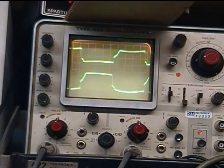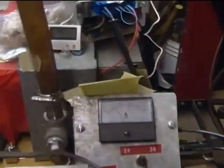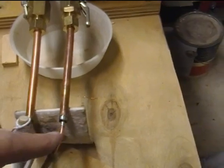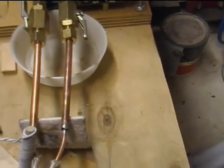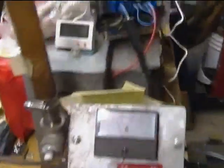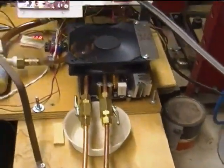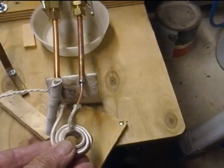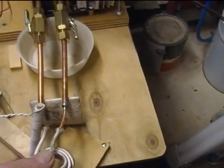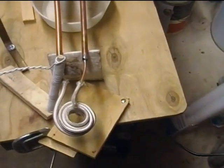One more time. I'm actually dimming the lights as the power supply goes up to 30 amps, which is a lot more than it's supposed to. I've now had the system powered up and running at 14 amps using this tiny 1/8-inch OD tubing with my existing water pump system for about 9 minutes. We started out with a water temperature of 74 degrees and we're now up to 99, with the cooling fan for the radiator running. There's quite a bit of heat at 14 amps, but the coil is warm to the touch through the insulation — it's not overheated. The system is able to carry away the heat from that small coil, which is one of the two things I wanted to test here today.